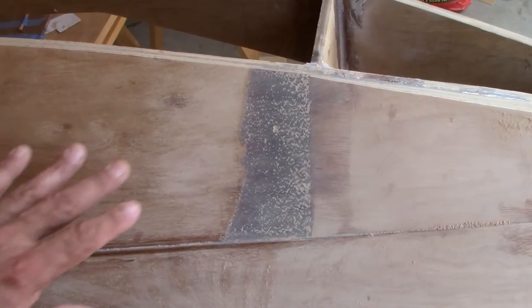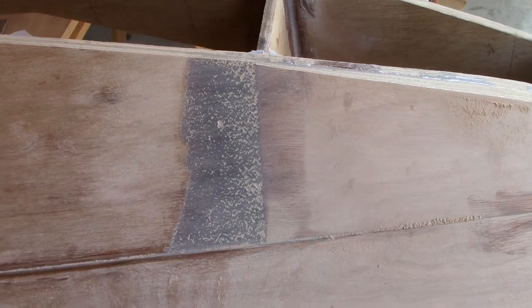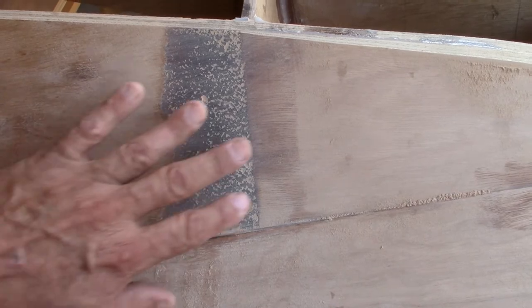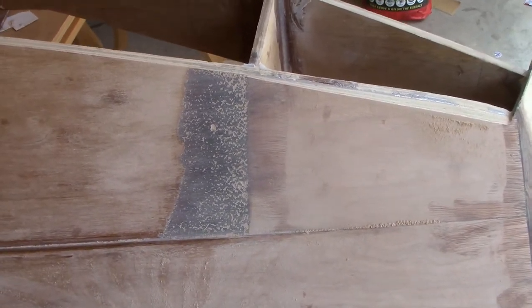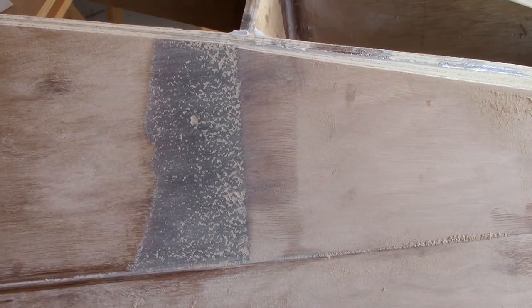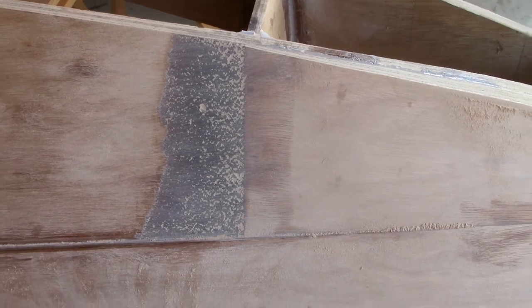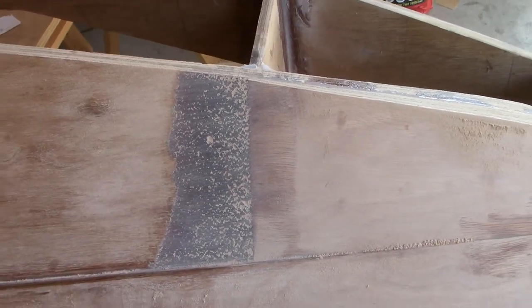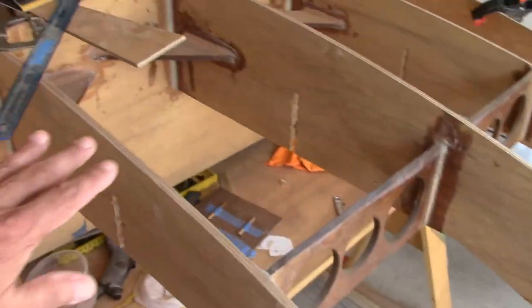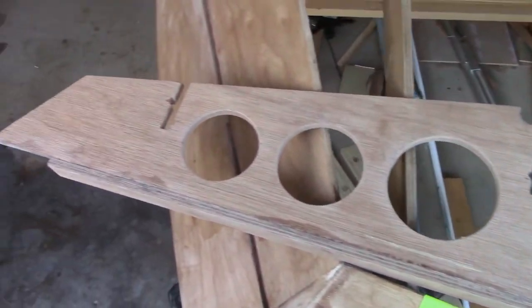I've been sanding on this and it looks okay, but that homemade wood flour was a little bit coarse and it did result in some pitting — not going to hurt a thing. I can just skim over that with more fairing compound. I went ahead and ordered the wood flour product from Boat Builder Central out in Fort Pierce, Florida. When it gets here I'll make proper fairing compound and put a skim coat from about here back, feather that out nice and smooth, then it'll be on to the next step: making the bottom panels.